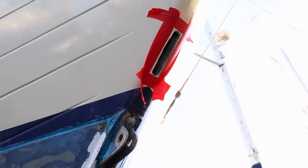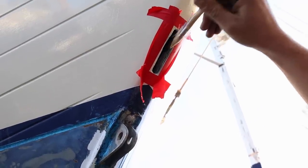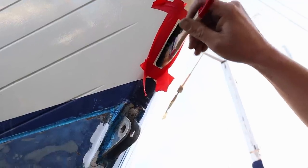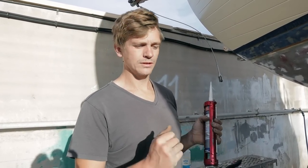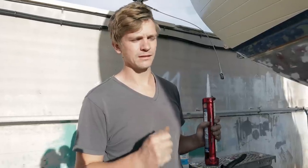After coating the inside of the new slot with unthickened epoxy, Ryan used a thickened epoxy to bed the new fitting against the inside of the hull. This was not to bond the fitting in place, but to provide an interface between the fitting and the curved inside face of the hull. Now that the epoxy has set, I hit it with a hammer to see if it was properly rigid, and it is.